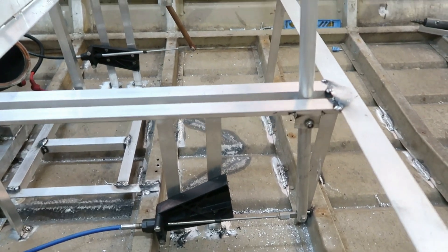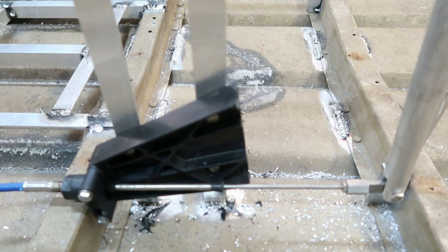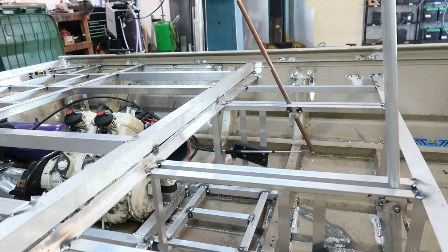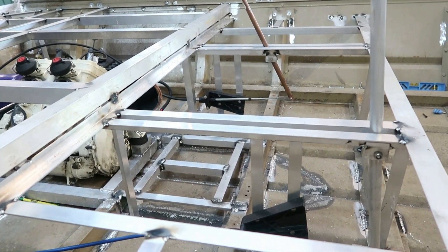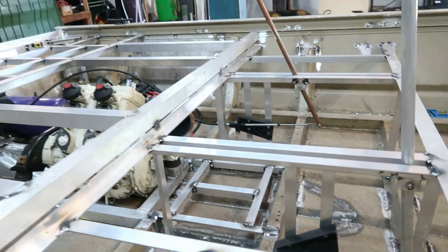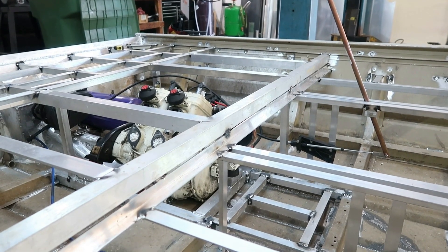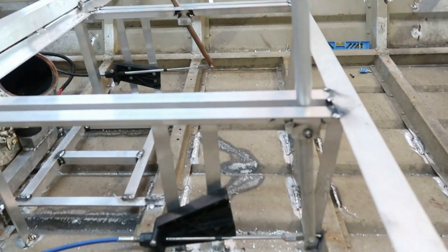They're both the same design — I used the factory plastic bracket and just bolted it to some angle tacked in. All this framing that you see is just tacked for now, because anyone that welds knows you don't go welding until you're 100% sure, and I'm not yet since I haven't started cutting the deck plates and getting ready for hinges and everything. So you don't want to go welding all this stuff up until you're to that point — for now it's just all tacked in.